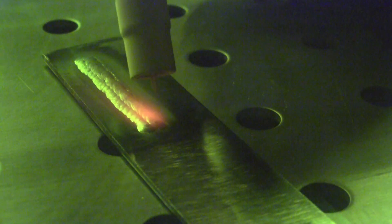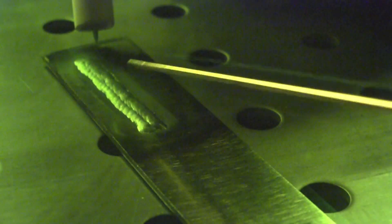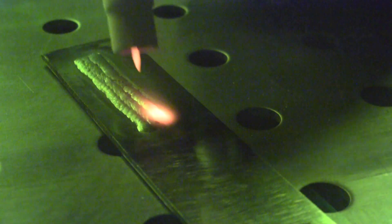If I did have one critical thing about the machine, it was the foot control itself. The idea of using the Cat5 cable connector is a great tool and a great idea, but the foot control mechanism seemed to be a little sensitive. When I finish this third weld and start to pull the tungsten and torch away, you're going to see one more arc when the tungsten is about an inch to an inch and a half away from the material — that was just from slightly wiggling my foot on the foot control. As I made some of these videos, I had that repeatedly occur: a kind of random arc that would happen if I just slightly wiggled my foot.